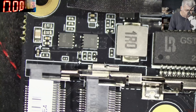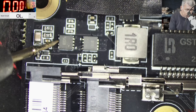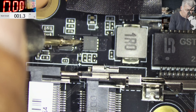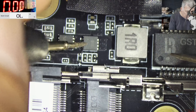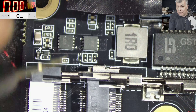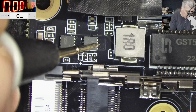Let's grab the multimeter and check. Checking with ground here — not short. And here is short! And here is short. 1.4 ohms, 1.3 ohms — and this MOSFET is gone. One ohm. So we have to remove this. But actually, this is a second fault. That MOSFET is a second fault — the main power is still shorted to ground. We check here compared with ground and we have 1 ohm.